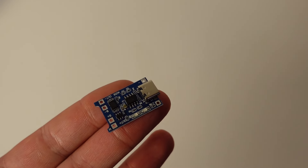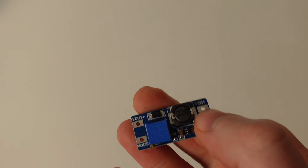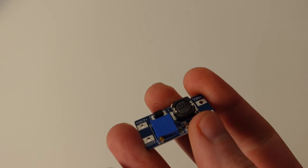With that out of the way, let's get cracking. To do this modification you're going to need a few things. Starting with a USB-C charging circuit, preferably with charge over- and under-protection on it. You're also going to need a DC-to-DC converter — this one is a variable converter, because I couldn't find any that went directly to 7.2 volts.